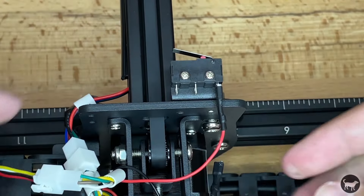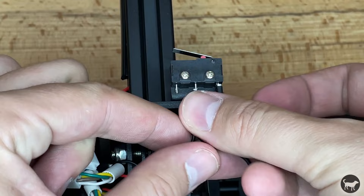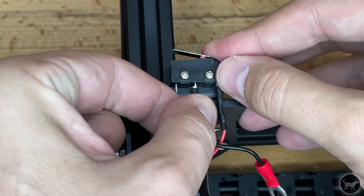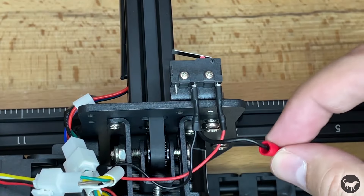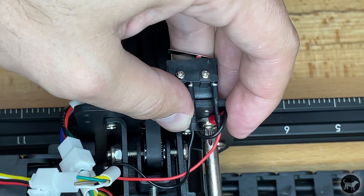On this model, the red button is on the right, so the red wire goes on the right. The black wire should be installed in the middle terminal. The ground wire should be installed just below the switch with an M5x8 screw with a nut on the back.